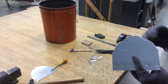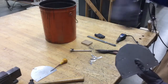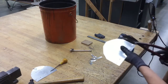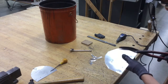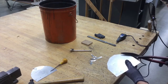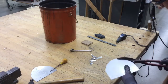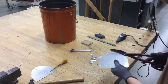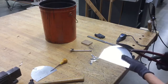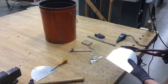Same basic process, except we're cutting on the line and we're gonna cut one small little piece at a time. Do not go for the whole cut in one shot. You're gonna have some difficulties if you try to do that. So we're gonna cut directly on the line, turn a little bit, cut off the extra, repeat the process, cut a little bit, and turn, cut off the extra, and just work your way the whole way around, just like that. And it's tricky, but the more that you do it, the more practice that you get, the easier it will be, and the nicer your cuts will turn out to be.